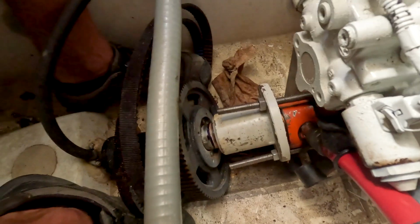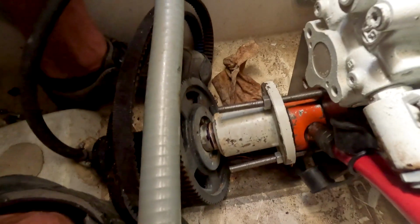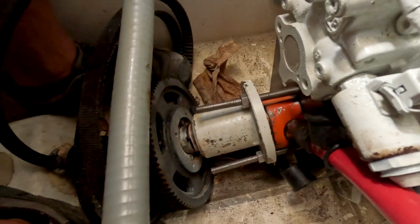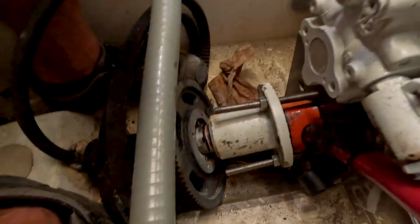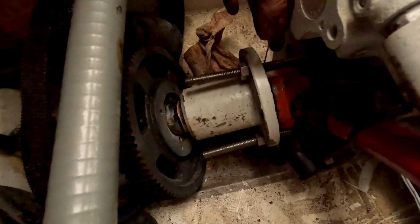We were able to get it to pop loose about that far, but it still needs a little bit more encouragement to go all the way, because the coupler is scared, doesn't really want to come off. He's been on there for so long. So we added a few more spacers inside there. Really what I do, because it's so tight there, is I take that little string, wrap it on the spacer, drop it into place, line everything up, and then tighten these bolts down.